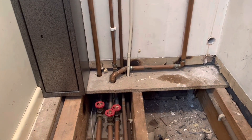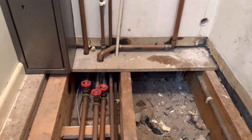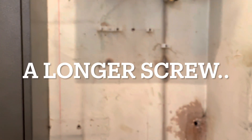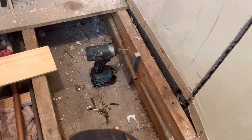I know it's only an airing cupboard, but it shouldn't take that much longer. A few more materials needed, but it is what it is. Clips are on, just need a long one for the gas. I've had to drop this return one lower because of course it would have landed on the filter, which is a shame. But never mind — cut into the gas there for our tee.